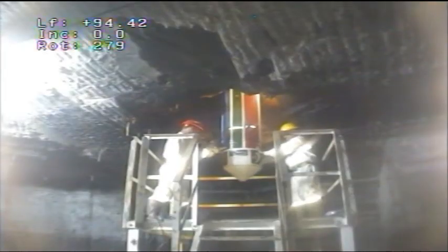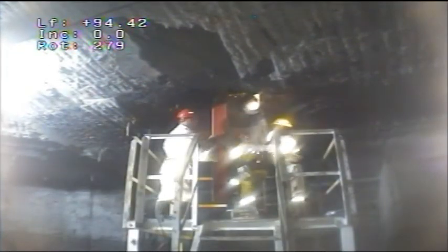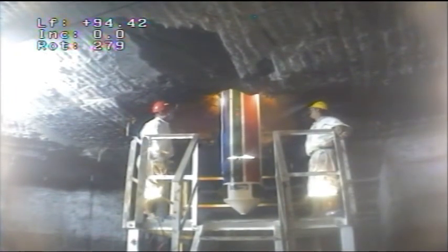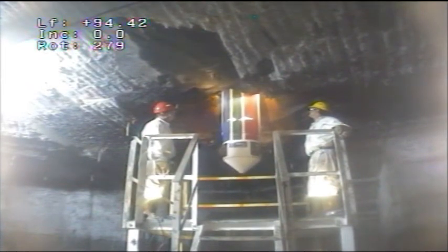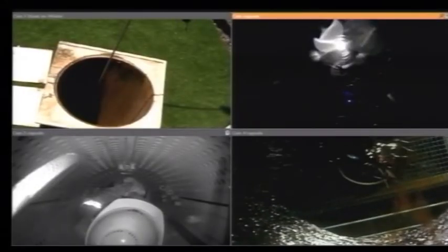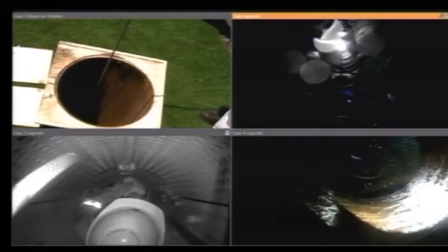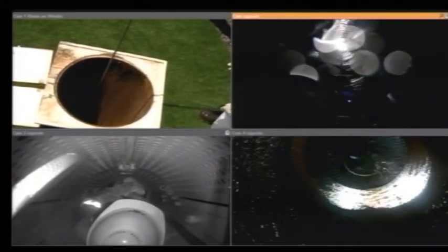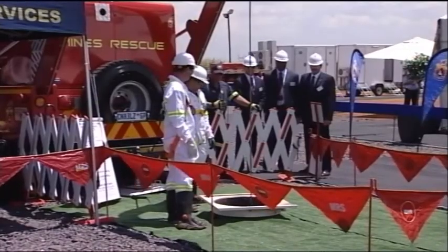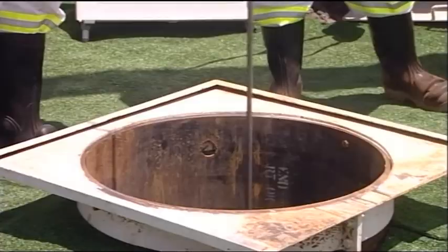It takes approximately five minutes to trip down the hole. Notice the first rescuer — he will then communicate to all the trapped persons. By means of a triage system, they will decide who will be the first person to be rescued. This person will be briefed on exactly what to do and will have an open line of communication at all times to the driver. A lock will be inserted from the outside so that the untrained person inside the capsule cannot inadvertently open the door. We do have magnetic switches on the door, so if it opens, the unit will trip out automatically. Once in the capsule, the rescuer will then signal to the driver that they can now start to raise the first person to surface.